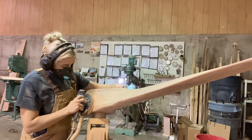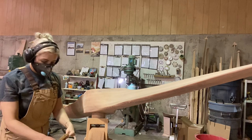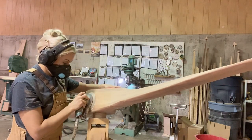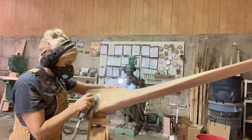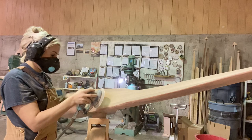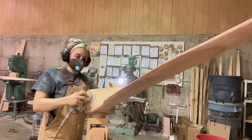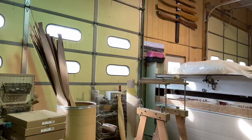I think this ended up with a six inch hub thickness. Generally for props I do a two-and-a-quarter inch or three inch hub thickness — those are my sweet spots. You go more than three inches and you have a ton of material to work with, but something an inch and a half thick like a half VW prop, you have almost nothing to work with. I usually make one to two props like this every three years, so it's not something I do a lot — I don't have a set process. I'm kind of like, 'Hmm, how do I take care of this problem? How am I going to get through this one?' It's a challenge when it's not something you do every day.